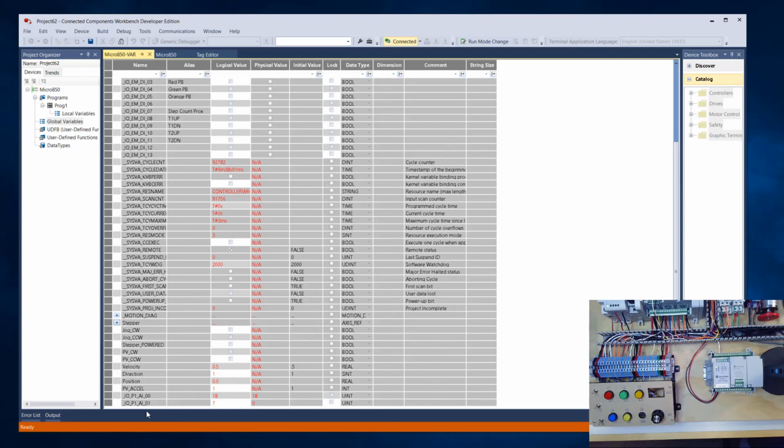So that's with the potentiometer turned all the way to the right. I'm going to start adjusting it to the left now. And you can see the numbers increasing as I rotate it. So we went from 0 to, if I go all the way to the left, let's see what we get up to. So we get up to about 60,850-ish, we could say.